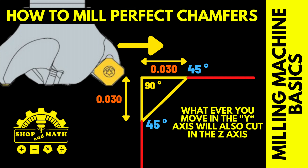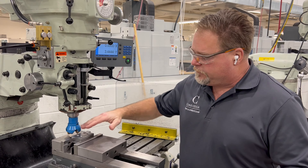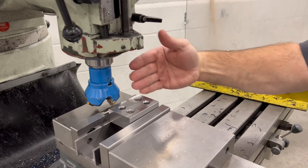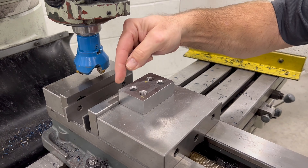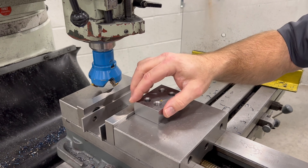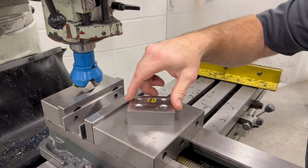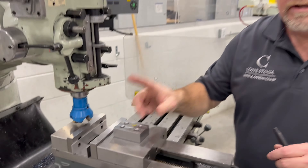Let's take a look at a demonstration using the edge of a 45 degree face mill. This time we're going to come from the back side in. I'm going to put it up against the stop and then machine here, flip this over, machine here, flip it around, machine here, flip it over again, machine here, then do the ends — machine here, machine here, and then these ends. So I'm going to do all eight sides in one setup for the two blocks each.